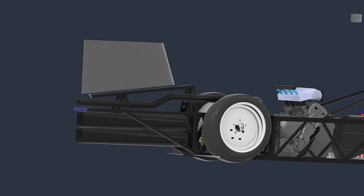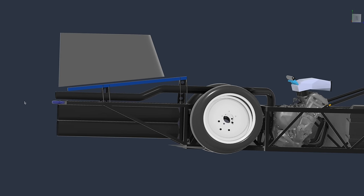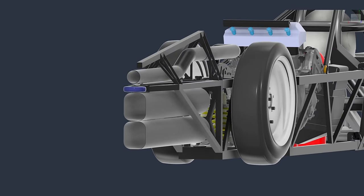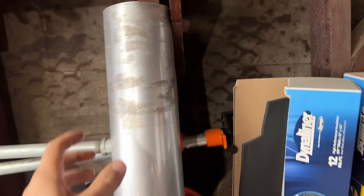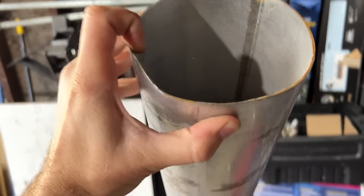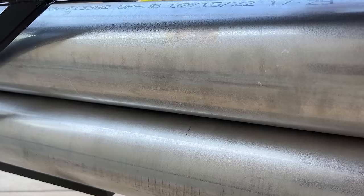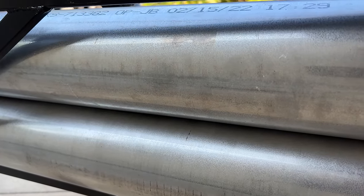I also need a spine at the top to hold the body and the fin, and I want the parachute tubes to be smaller. They are five inches in diameter — most people use six, but I want to go with four. Unfortunately, four doesn't really fit the parachute well, but a four-by-five does. The old tubes are actually exhaust tubes from an 18-wheeler — aluminized steel, five-inch tubes. They're pretty heavy, and while weight doesn't matter for car performance, I do need to remove the tail to store and transport the car, so I want it lightweight and easy.